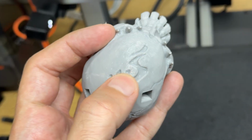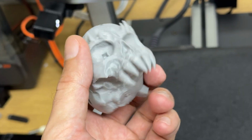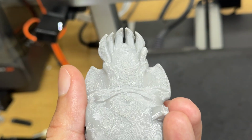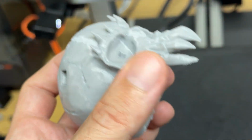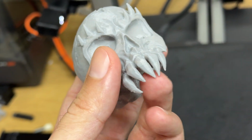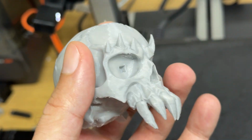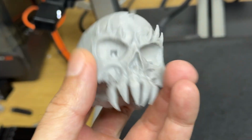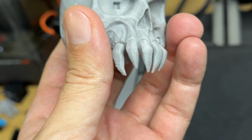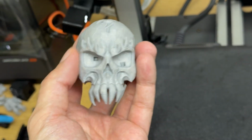Even the top part looks really astonishing with 0.16 layer height, and this pointy part is really well made. And trust me, in majority of cases, if you print it on the default settings, you will get tips broken, and even this part catastrophically bad, because this is where it begins and going up. We see here a bit of layer lines, but nothing major.